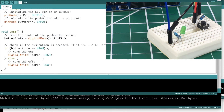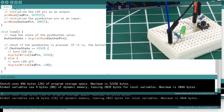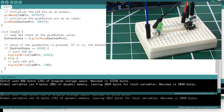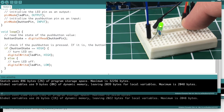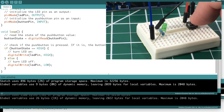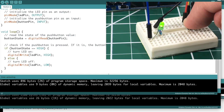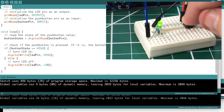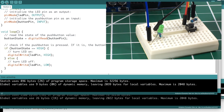Otherwise it writes LOW to the LED pin, turning it off if it was on. We'll do a quick compile — it's part of the IDE so it should be fine — then upload. The LED is off to begin with, and when we press the button, it lights up. The pin reads low so the LED is off, then we press it and the if-then statement kicks in and writes HIGH to the LED pin. Everything is working. That's the most simple button setup you can make. Check the link below for more on pull-up and pull-down resistors. See y'all next time!